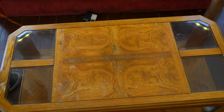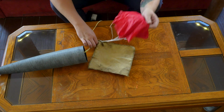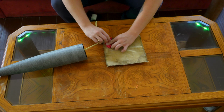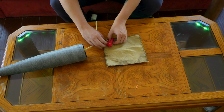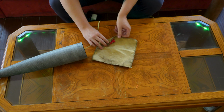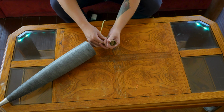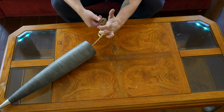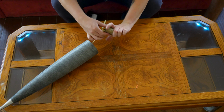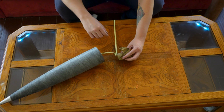Okay, we're gonna move this guy for a moment. So here you go. We got our little 12-inch Top Flight Recovery drogue here. The drogue chute, pretty unnecessary for the tube fin rocket, if I'm being honest. That thing would float down just fine with no drogue. But the end rocket, I like the idea of having a drogue so that it can't streamline if we tried to fly it drogueless. So we're packing it as close to how the end rocket will be packed, because after all, this is made to test that. So that's how our drogue chute's gonna get packed.